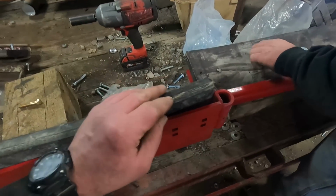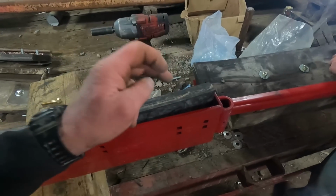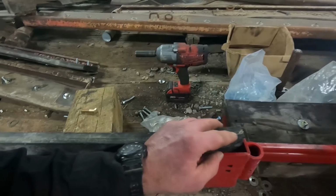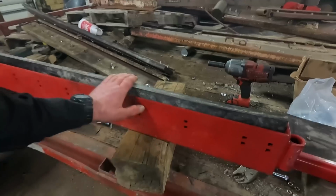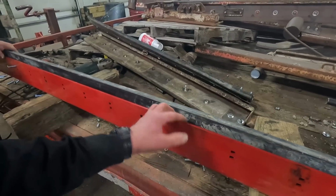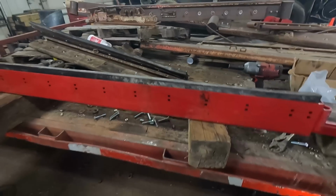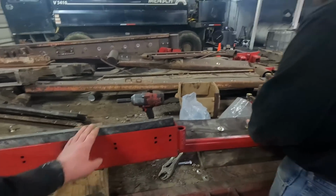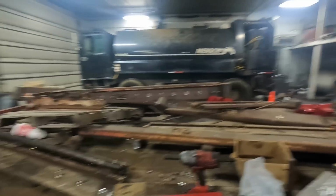So this is just 1-inch conveyor belting. Now this is similar to the stuff that we have on the floor in the cow barns. However, this does not have the cable reinforcements in it. This has just got string or rope or whatever to kind of hold that together. This wears a lot better than the metal. You can get reversible metal edges to put on here, and we've tried the poly too, and this rubber seems to work a lot better, doesn't it, Nate? Sure. 4 times as long, right? At least. Yeah.